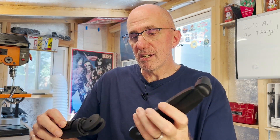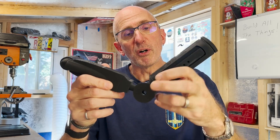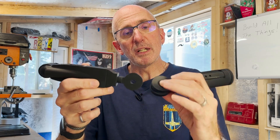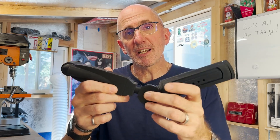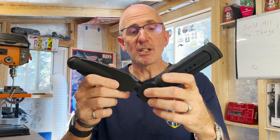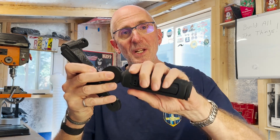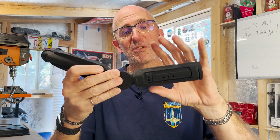The last thing for this episode is a revisit of the 3D printed droid. Dave Moog from Droid Division was kind enough to provide me with a step file for the left arm, which I can import into Fusion and then do some redesign on it. So I've got the pieces here — this is the upper arm and this is the lower arm. This is the current elbow right here. What I need to do is somehow put some bearings in here so that it's not rotating plastic on plastic. I really want to put in a bearing because plastic on plastic will not wear very well.